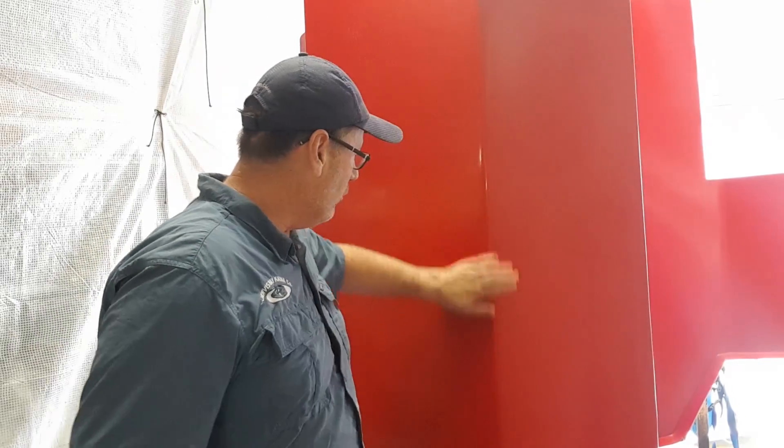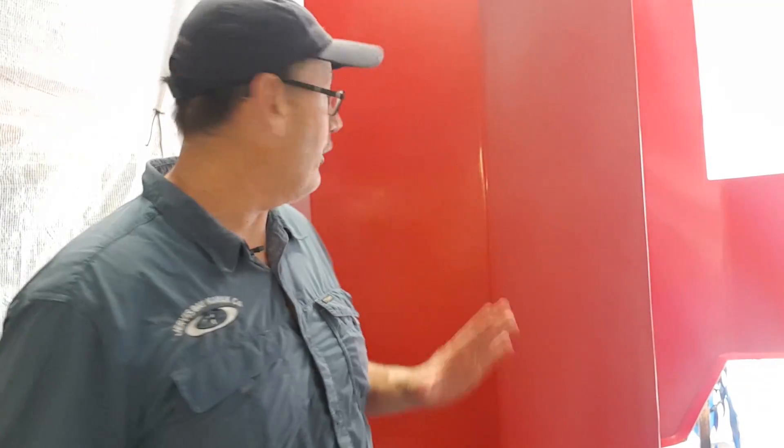There's a tiny little area on the top step that needs a little bit of plasticine — I'm not going to do a full repair as it's just gel coating. If we ever produce another boat out of these moulds, I'll definitely do that. But all of the edges, rebates, and flanges are in such good condition on this module. Given it's been moved three times on the back of trucks with straps, sat out in the sun in all types of weather including cyclones and storms, and baked out here in my factory for another two years — for a day's work, definitely worth the effort.